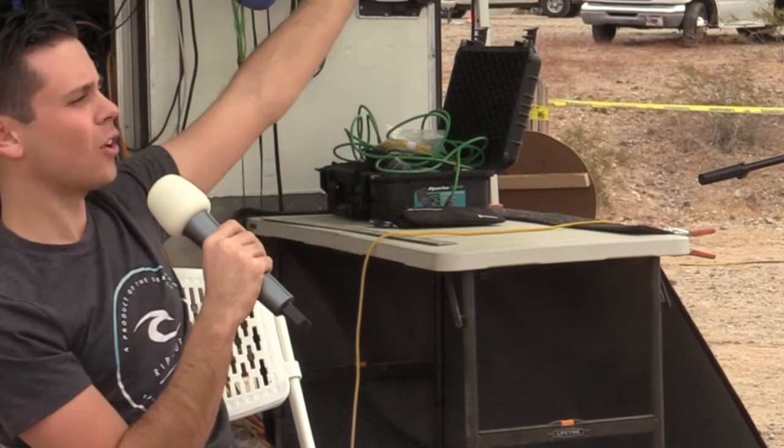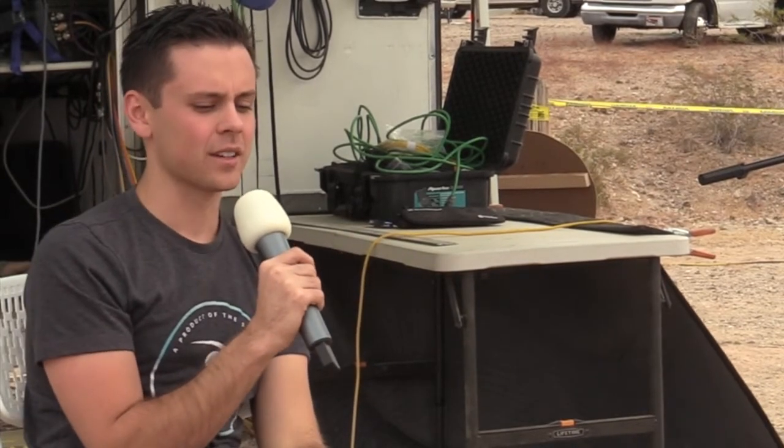With a lithium battery, you're at full charge rate, full charge rate, full charge rate — boom, you're done. It's instant. With lead, it's like, oh I'm rising, it's so easy — then it's harder, harder, and you don't want any more. Once it's at 90 to 100%, the efficiency decreases. You can get down to 55% efficiency in the data sheets — that means 1,000 watts of solar becomes effectively 500 watts. It's horrible pushing power into lead acid.